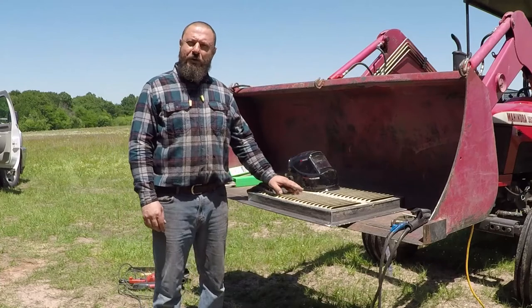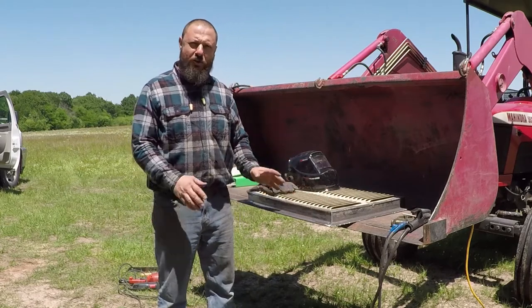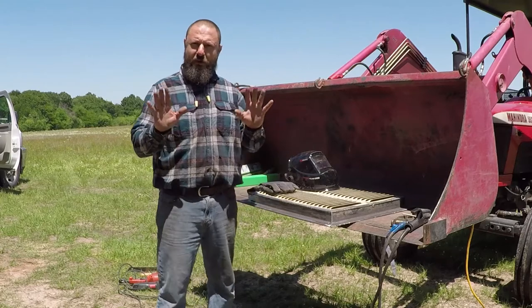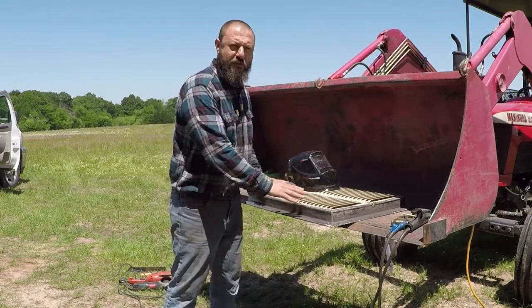This is the fourth window I built for my shipping container. They all came out good. I weld them in small passes so they don't warp. I also ground everything flat so it will fit perfectly against the shipping container, and also it will be better for the paint to adhere to these surfaces.